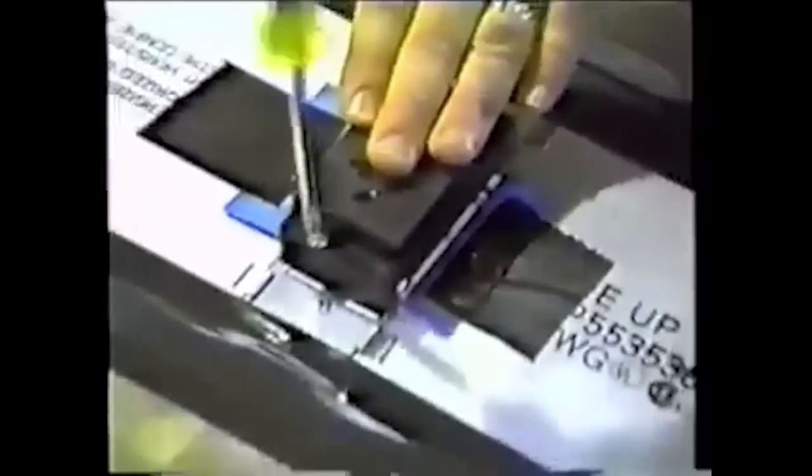Remove the white tape protecting the DCR terminals and, matching the phase color marking on the DCR receptacle with the cable phase colors, install the DCR receptacle to the base plate by installing and tightening the 3 receptacle mounting screws. When all 3 screws have been tightened, termination will be made to the cable by the insulation piercing terminals on the bottom of the DCR receptacle. If a 5-conductor DCR is used, install a 5-conductor circuit adapter to the base plate first, and then install the DCR receptacle on top of the adapter.